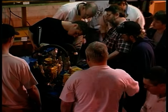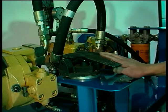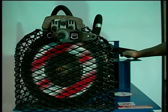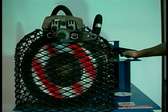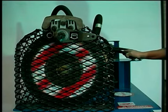Now let's take a closer look at TigerCat's hydrostatic drive demonstrator. The hydrostatic demonstrator is fitted with a proportional double pedal drive control valve. One pedal directs forward machine travel while the other directs reverse travel, exactly as we find in TigerCat's skidders and wheeled feller bunchers.